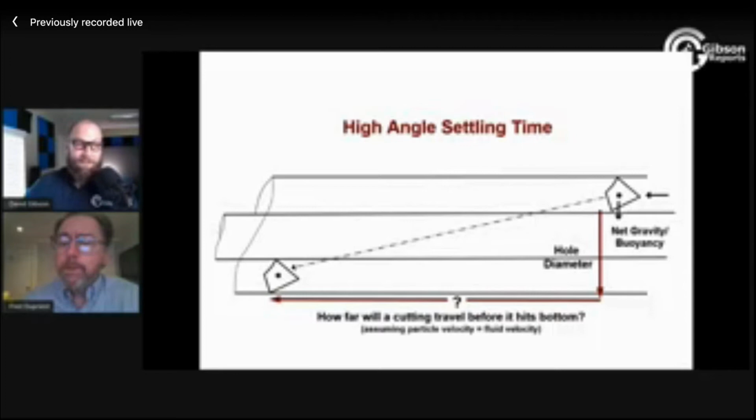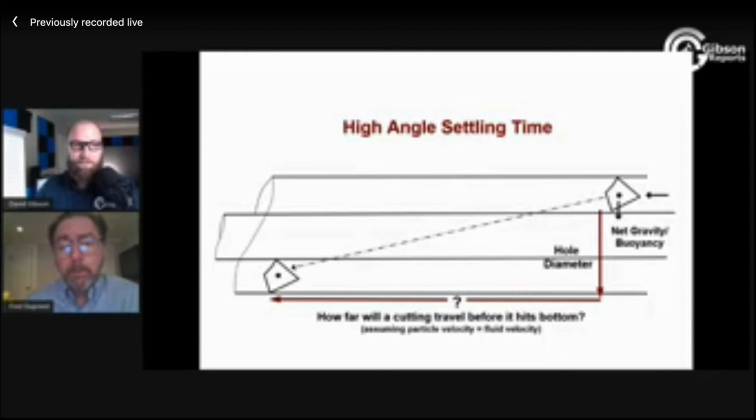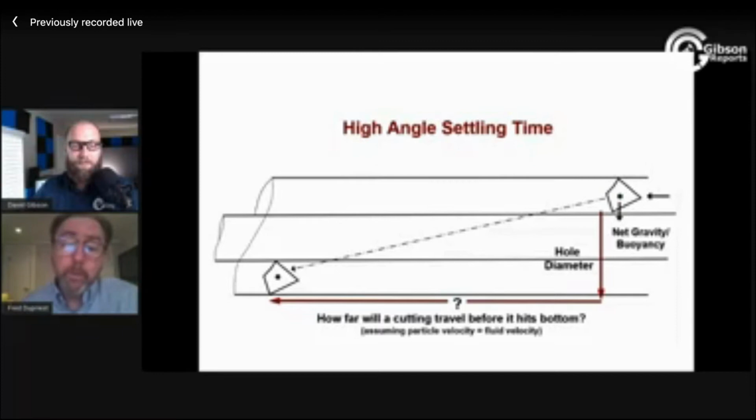Generally, in land wells, in the unconventionals, a lot of our losses are difficult to treat. In high angle extended reach wells, they're largely due to ECD, and managed pressure drilling can work that. And then the third big scenario that we don't have as much of anymore is we're penetrating old depleted sands, and we can stress those back up with a high degree of success pretty much every time.